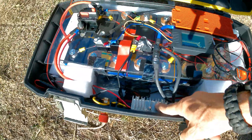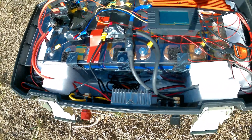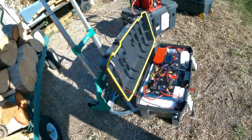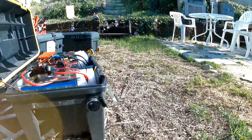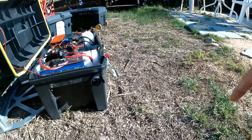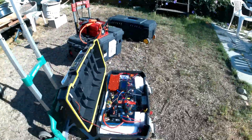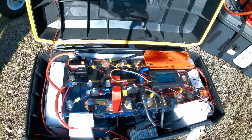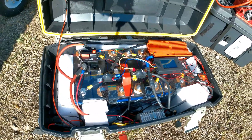I have a 12 volt buck down converter, so there's a 12 volt DC port here. I put in a voltmeter — it doesn't really matter since this is 12 volt output and it's not reading the battery voltage; that's what the shunt is for. That's pretty much it — a pretty clean little unit, fits perfectly in this toolbox, and three kilowatts of power. Pretty clean setup.